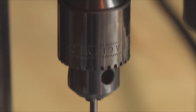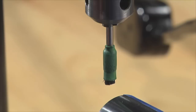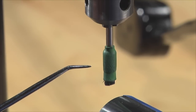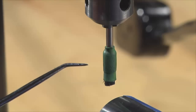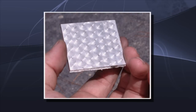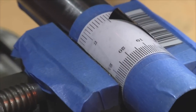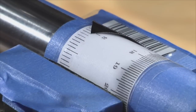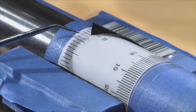To create the pattern on the metal part, you can use a proper jeweling tool, metal brush, or even a pencil eraser, depending on the look you're going for. We used a 5/16-inch metal brush bit found at a local hardware store. To help prevent the bristles from deforming when applying pressure, we put a bit of heat shrink tubing over it. Before you begin jeweling, practice on a piece of scrap metal. For best results, polish the part beforehand. Devise an indexing system for horizontal and rotational adjustments — in our case, we used a piece of aluminum can taped to the cross-slide vise as a pointer, and a printout of a ruler taped around the compression tube to indicate rotation.